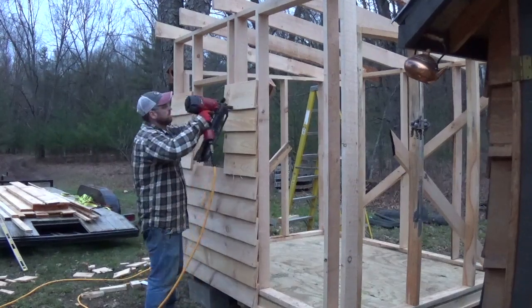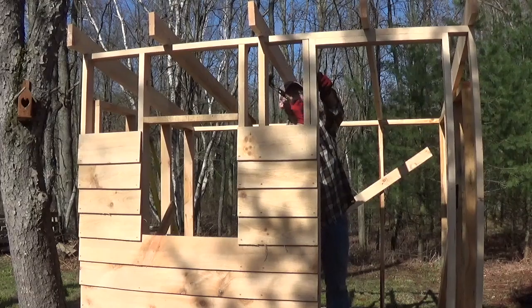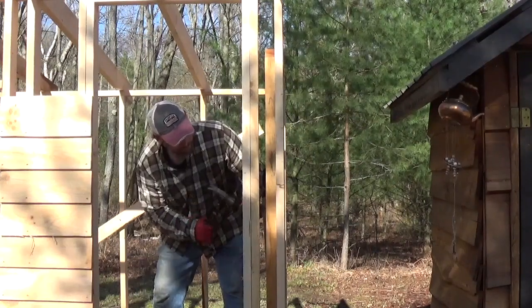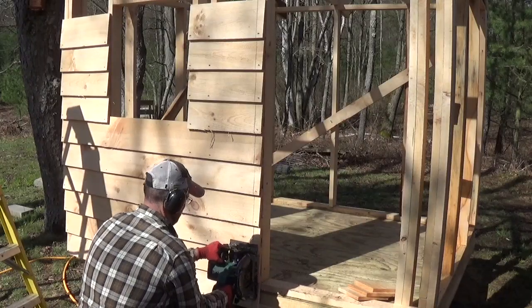I bought just enough lumber, and right here I realized I actually was cheaping out too much. You have to have 2 studs so that you can get the spacer at the end of your siding to put the trim on, and it blocks everything out. You also need an extra stud at each corner so that your trim has something to nail to there.